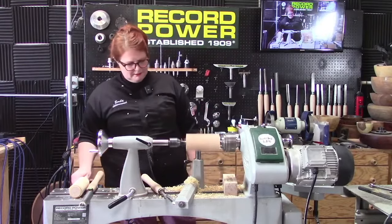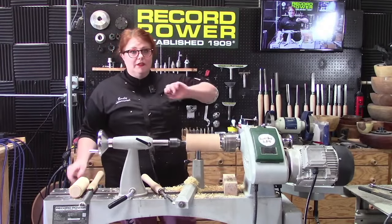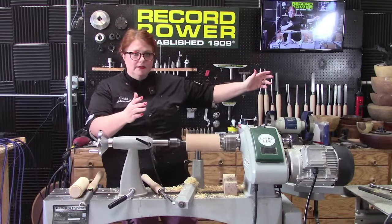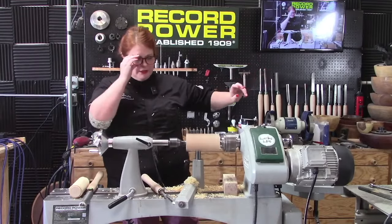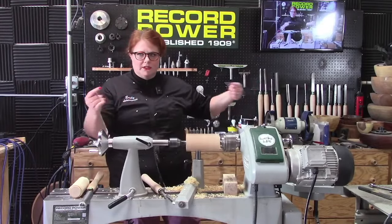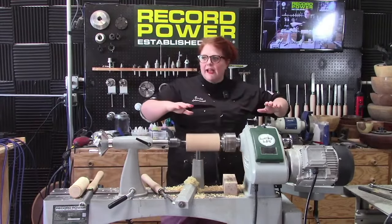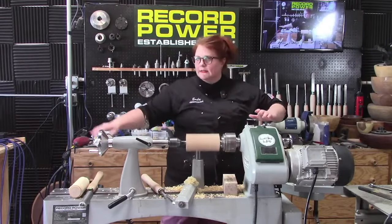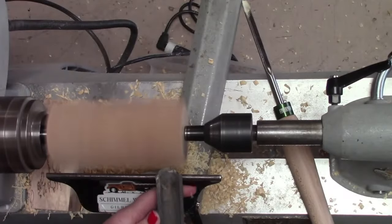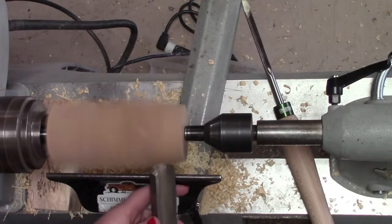We're going to turn up the lathe speed. Whee! There are formulas and everything that you're supposed to learn when you're a turner for safety speeds. I go until I feel like that's right. Bowls, not so much. With bowls, I try to follow the pattern because you'll get through that first little bounce. With spindles, you don't generally get a bounce because you're usually turning square stock. I like it to be so fast that when I put my tool to it, it just glides, even if it's square stock. So anchor the tool rest, pick up that heel, rotate over, and that's about the right sound. That's about the speed I like it to be.